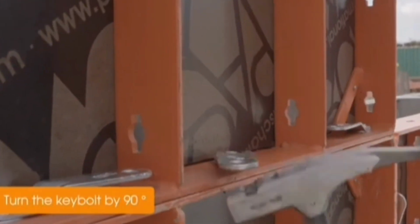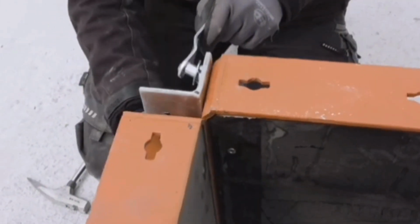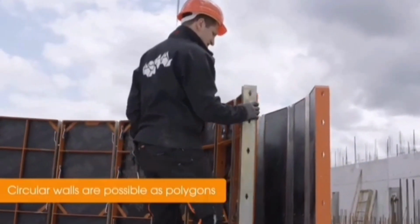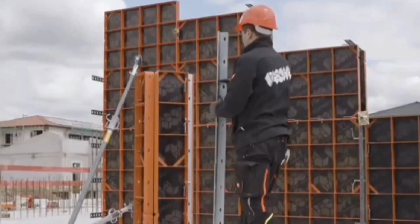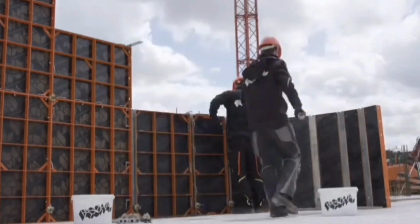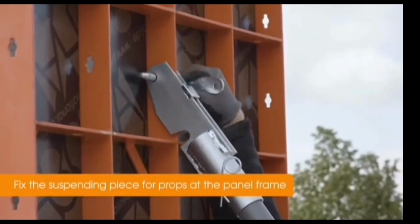And thanks to its modularity, the formwork adapts easily to any floor plan and any height parameters to within an inch. For example, the formwork was used to create the treetop walk tourist attraction, implementing 112 supports ranging in height from 16.4 to 75.5 feet.